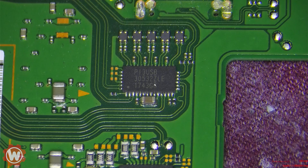We're back — this is another customer request video. As you can see, we have a Nintendo Switch here, a regular original Nintendo Switch, either version one or version two. It's not docking. As you guys probably already know, the docking issue is usually related to this chip, the PI3USB chip.